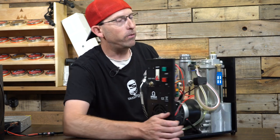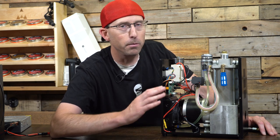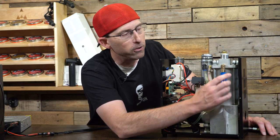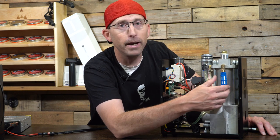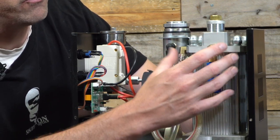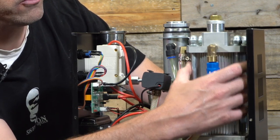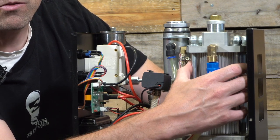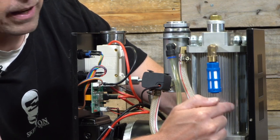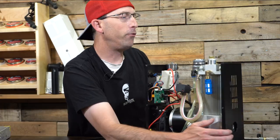Let's start with the air filtration system and how air travels through the unit. Air enters the top of the piston from this side — it is filtered, and you can buy replacement cartridges. Since this is in the back of my vehicle, people worried about dust, and this filter keeps any dust out of the air being pumped into the air gun. The cylinders are all aluminum, which cools rapidly and gives off heat readily. The cylinder also has fins on it to help alleviate heat buildup.